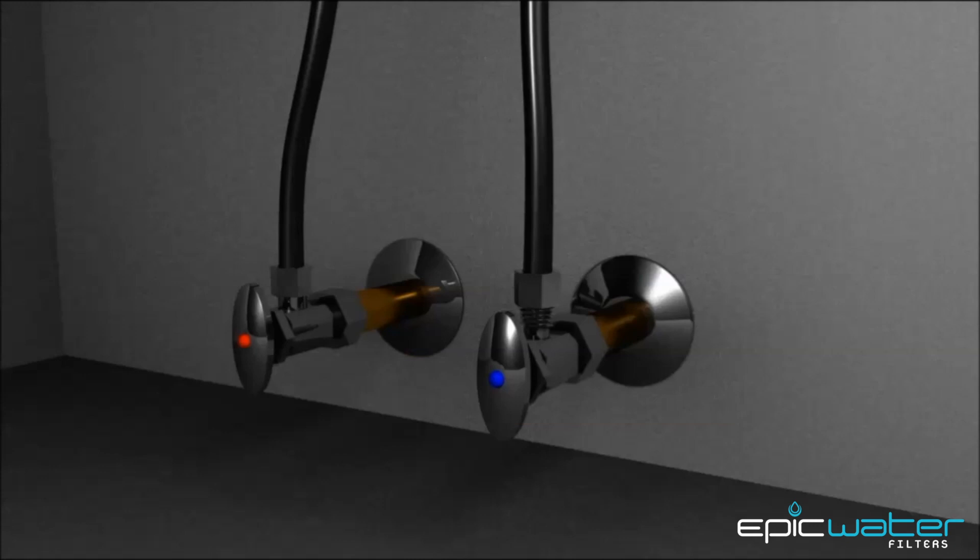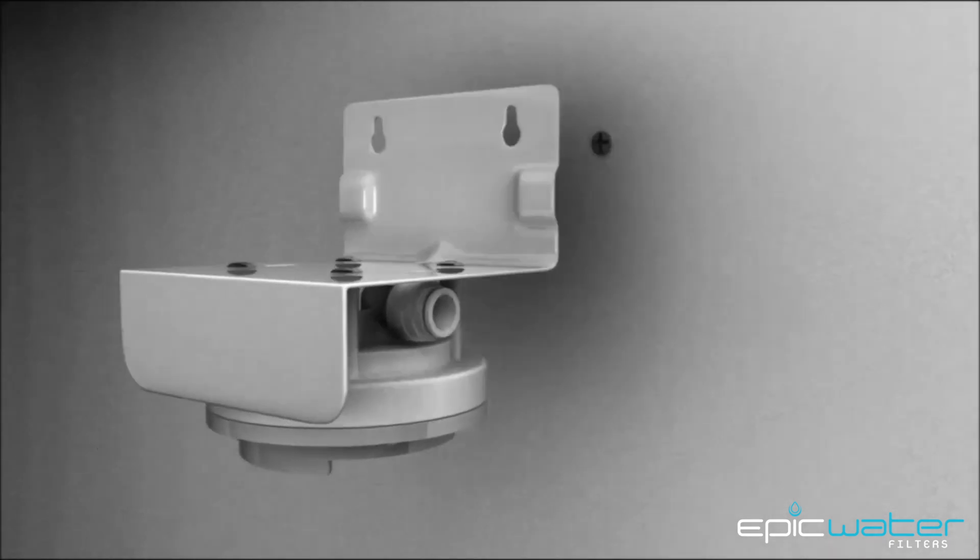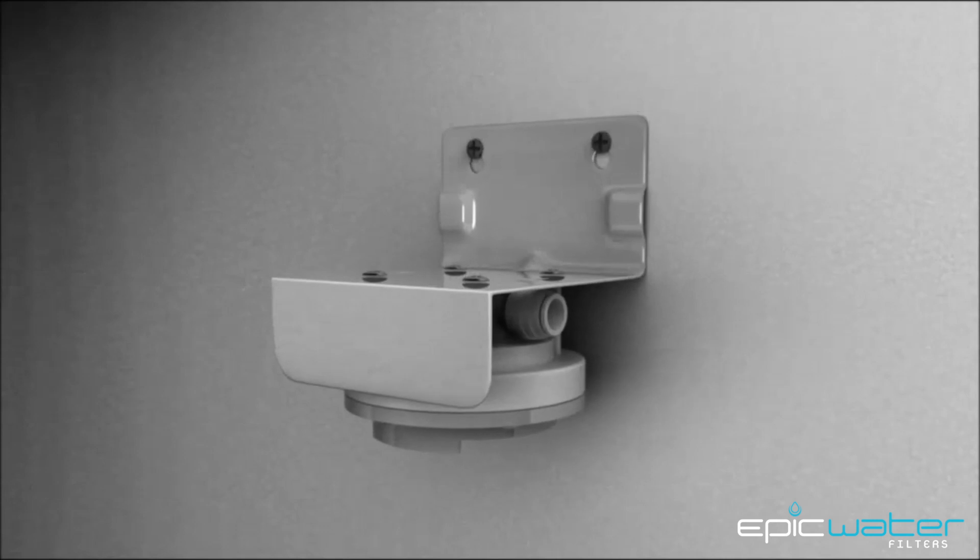After you've measured for the proper clearance, turn off the cold water shutoff valve located under your sink, then turn on your cold water faucet so that the line to your faucet fully drains of cold water. Next, using the mounting bracket as a guide, you'll measure, then insert the proper screws to secure the mounting bracket and attach it to the side wall under the sink.